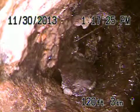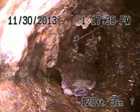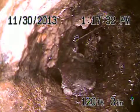You can see up ahead, you have a lot of roots there. This is at the property line, approximately about four and a half feet deep. We're going to recommend to dig that up, repair that section, put a clean-out there.